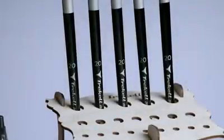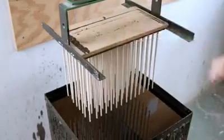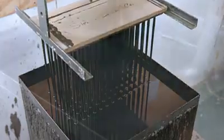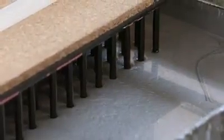To make the paintbrush handle, a worker inserts birch dowels in a pegboard, then mounts the board upside down on a dipping machine. This machine submerges the dowels in black lacquer paint. After one day of drying time, there's a second dip, part-way this time in silver paint. The machine has markings to indicate how deep to dip the dowels for each color.